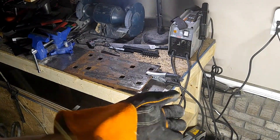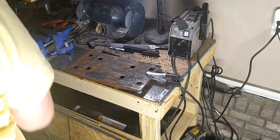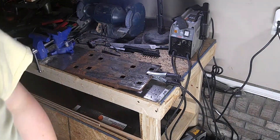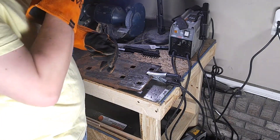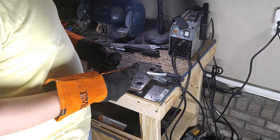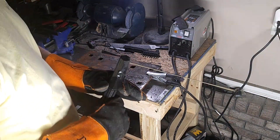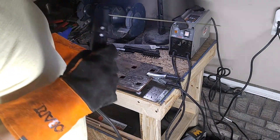When you're welding, always make sure to wear your welding gloves, welding shoes, and helmet. We've got a Mark 100D welder made by Smarter Tools, runs on 110 volts. It does 49 amps or 70 amps. Since this coat hanger is closer to a 3/32nds rod, we're going to run it on 70 amps. The coat hanger fits in the electrode holder — there's our makeshift electrode. Let's see if we can strike an arc with this thing.